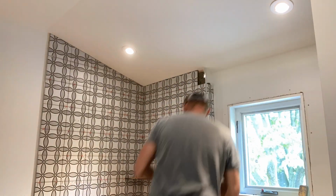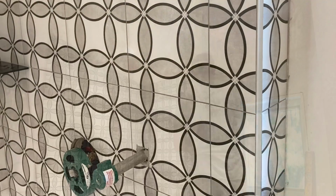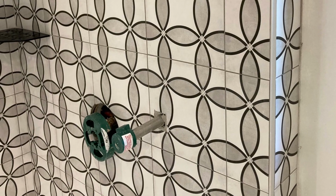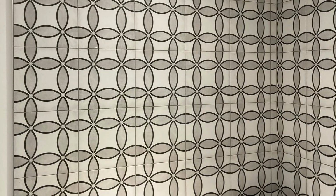You hide everything with the grout, which is a warm grout, so it matches more of that little tint of gray. Not the flower, but that white part. So this is drying, the process. I'll come back the next day, and I use a new Flex 302 silicone. It's going to be translucent, and it's got vinegar in it, and it won't mildew or anything like that.